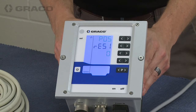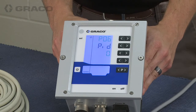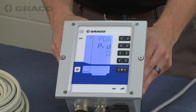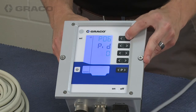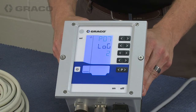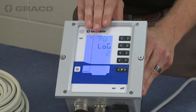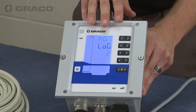Screen 5 is unused. Screen 6 is the CAN purpose ID screen, which is used to identify this device to other devices in the Graco CAN network; it can be set to whichever number you want. Screen 7 is the logging level of the device. There is a provision for an SD card inside the box that will log the basic operating parameters in a text file, and this setting determines how frequently those data points are recorded.